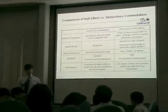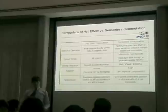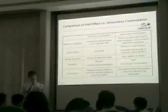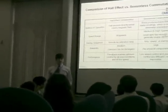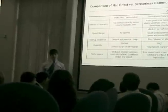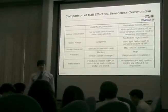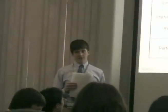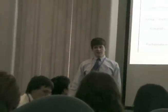Here's a table comparing hall-sensor commutation with sensorless commutation. Hall-sensor commutation uses hall sensors to directly sense the rotor's magnetic fields. It is capable of driving at any speed and any load, limited only by the motor, and uses a smooth acceleration ramp to start. It relies on hall sensors, which may be damaged during a laser shot, but allows good control over any load condition and at low speed. In contrast, sensorless commutation relies on reading the back EMF induced in the stator windings by the spinning rotor. It is only reliable at medium to high speeds, because the rotor must be spinning fast enough to induce a usable voltage. Startup may be rough because when the rotor is stationary it produces no back EMF, so the microcontroller must assume an arbitrary state for the phase windings to start the motor. It is very reliable because it requires no physical components; however, low-speed and position control are not possible.